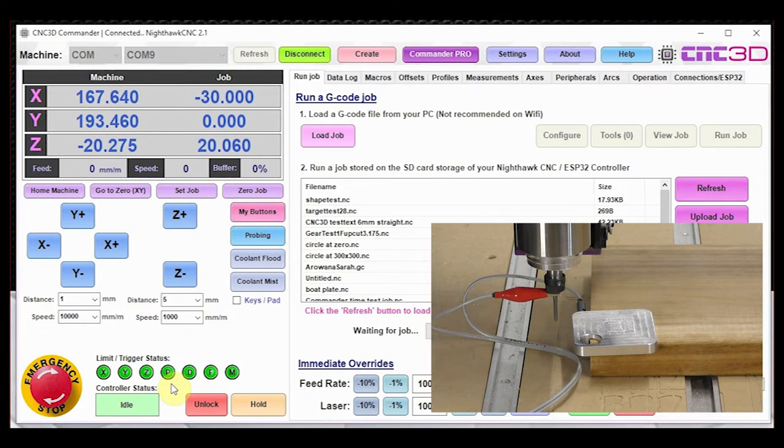The alarm light on 'P' lit up when we touched our probe against our tool — that means we've set things up correctly. A tip: if the light is flickering between green and the alarm color, try swapping your probe wires around. This will fix the issue most of the time. If you're probing large bits of alloy or have an alloy bed, you may need to swap the wires to work with an inductive probe.